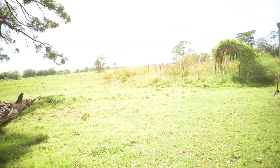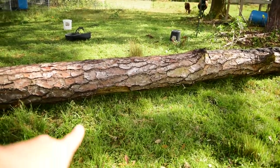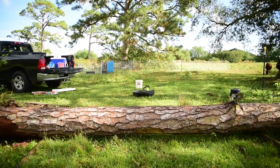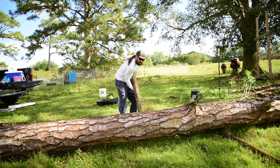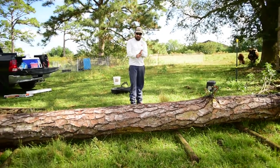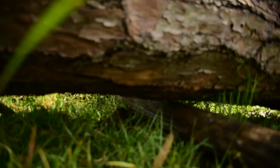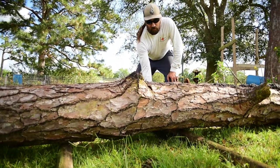We're gonna leave this deck stand — there's a big huge gap now with it right here in case she starts rolling. What we're thinking we're gonna do is go ahead and cut this bad boy in half, cause it's supported now — it's supported here and on the other side — and that's gonna keep her up off the ground while we make our first cut. Cut it in half — that's definitely gonna be easier. I'm pretty sure I got enough clearance. Yeah, you can see through — down here I'd say you probably got about four or five inches. The biggest thing is getting your blade underneath without touching the grass, cause you gotta put your relief cut underneath.